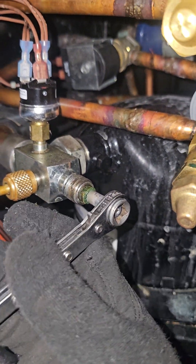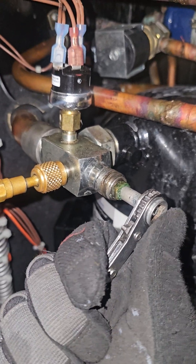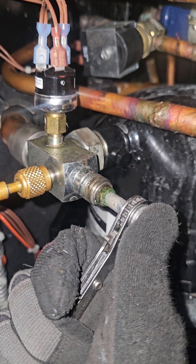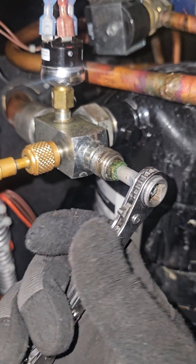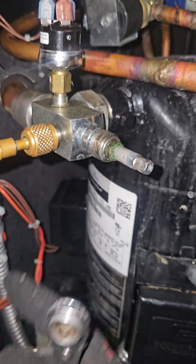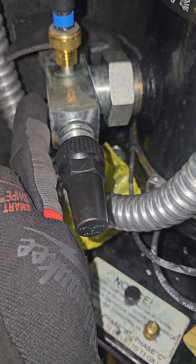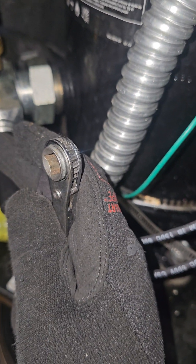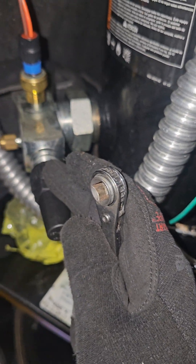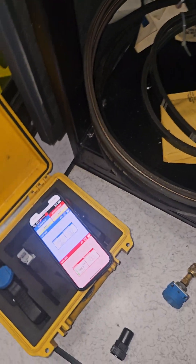So that's your high side pressure. Now in your case, you might be using standard gauge manifolds with hoses, in which case you put your red hose over here for the high side pressure, or discharge pressure, or head pressure, or high pressure, and your blue hose over here to get your low side, or back pressure, or suction pressure. Okay? That's it, HVAC beginners.